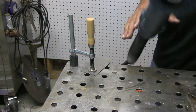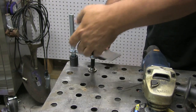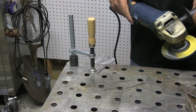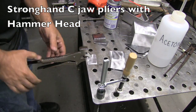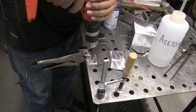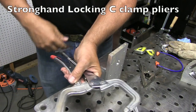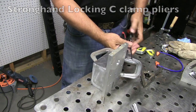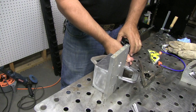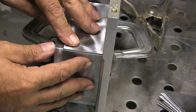We're going to build these brackets today — chill blocks, pulse settings, handy hold-down tool, speed tacks, etc. This is a little Strong Hand Tools fixture point table, and this little clamp on the corner is really handy for stuff like this. I'm going to drill a few holes before the fact since it'll be a lot easier than trying to drill them after things are welded up. I save every block of aluminum I can get — these are just mismachined parts from a machine shop — and aluminum acts as a really good heat sink. So I'm building a quick heat sink fixturing station, get things tacked up here, and then weld them against that heavy block to pull heat out.